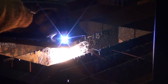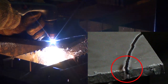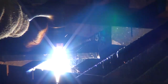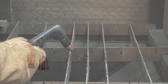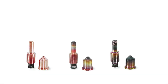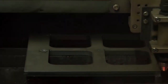Here are some key cues to alert you on when to inspect for consumable wear: if you need to slow down considerably or are not able to cut through material; green discoloration of the arc or fumes; excessive dross appearance; or the arc is misfiring or difficult to start. It is a common recommendation to replace both your electrode and nozzle at the same time. This will ensure optimal cut quality and will help eliminate any guesswork on when to replace.